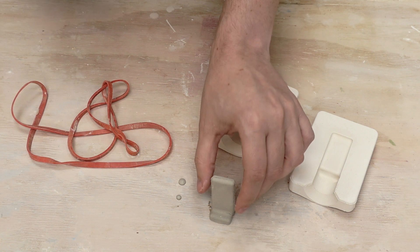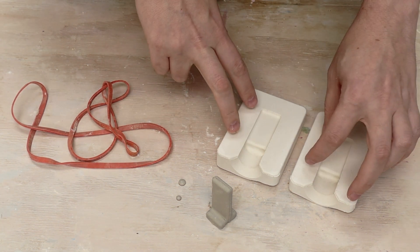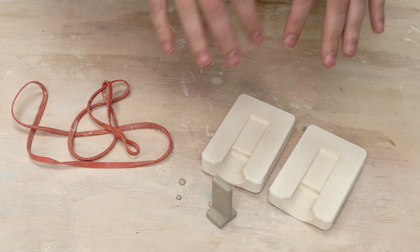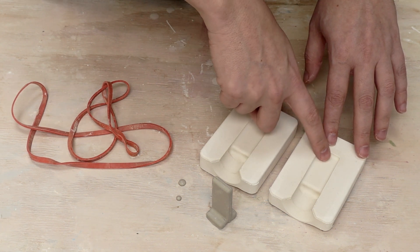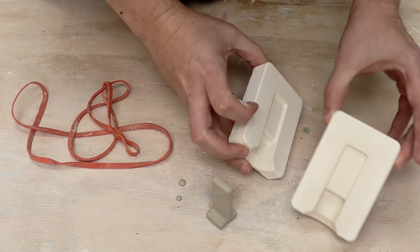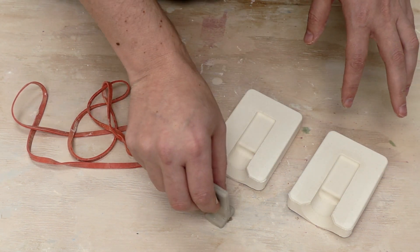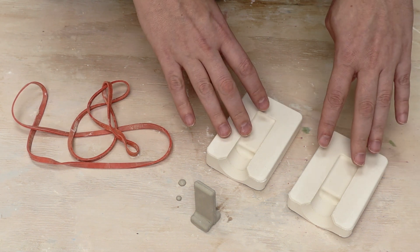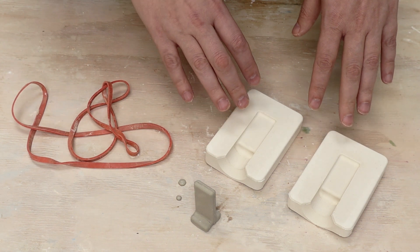So one test tile - I can just go ahead and let that dry now. I think this worked out awesome - this is probably my best mold so far. It being small helped. The only thing I'm really missing are a couple of divots so that the mold will seat together, and obviously when I poured it I didn't get the full height of the plaster, so I need to work on the 3D printed mold for the plaster a little bit more. But in terms of a mold for the slip I think this was awesome. Since this is in pieces I can actually go ahead and replace one side - for instance if I wanted a texture I could put a texture on one side of the test tile by creating a new 3D printed piece, a new plaster mold, and then those would sandwich together with one side smooth and one side textured. I might go ahead and make a few more of these so anytime I'm slip casting I can create a few test tiles and build up a large collection. Hope you found that interesting. I'm definitely going to try this 3D printing process more - I think this is probably my most promising attempt so far at creating plaster molds. As always, if you have any questions or comments please leave them below. Thanks - I will see you next time.